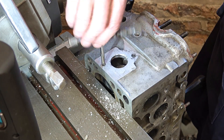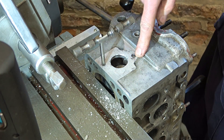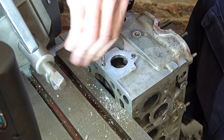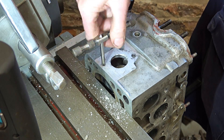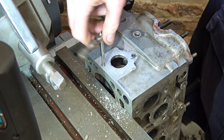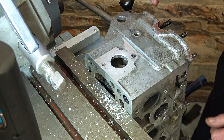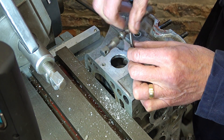Well, overall that's gone pretty well. Just clean this thread out here and this one here as well. Maybe next time you have a video from me I'll have my voice back. You know, if I was welding this again I would still take the current up a bit — maybe even as high as 200 amps. Which is a good reason that I got the 200 amp welder and not the 170 amp welder.